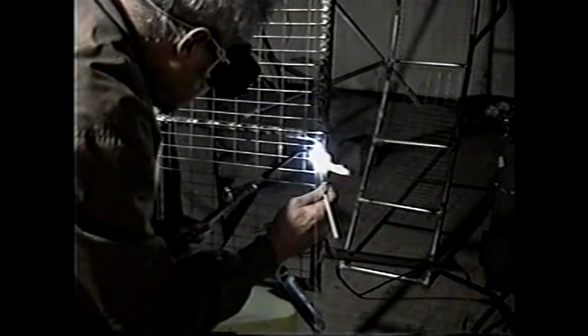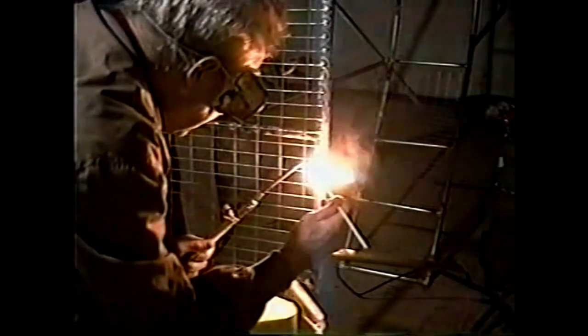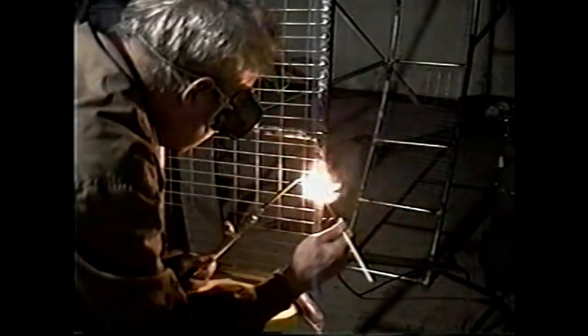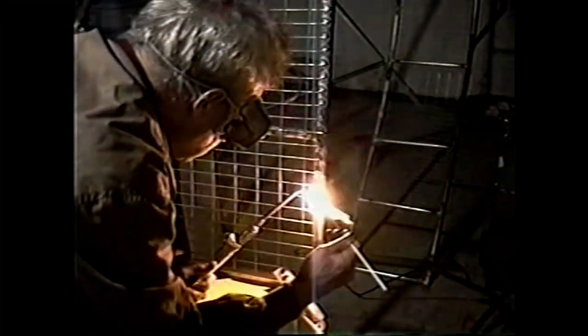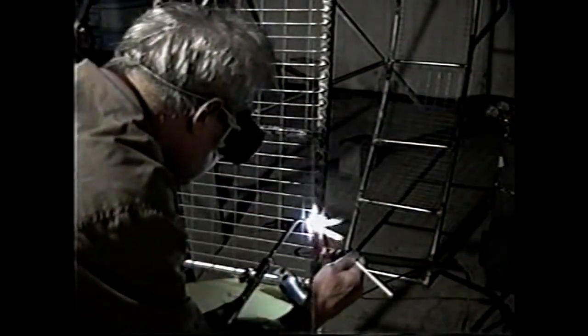With the rod held in the background, take a little heat and braze away. Looks like it might take forever, but it's actually quite a fast process. This wire is about 16 gauge, 1x2 mesh. This makes a lot better guard than the plastic wire ties, which allow the guard wire to buzz against the frame.